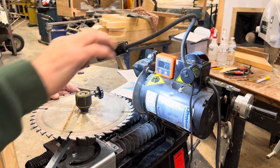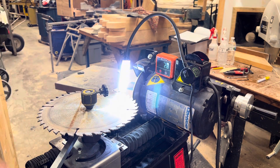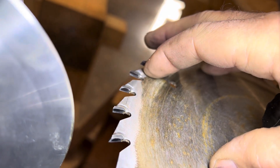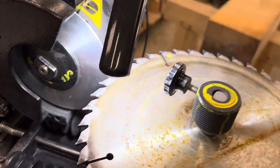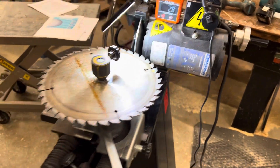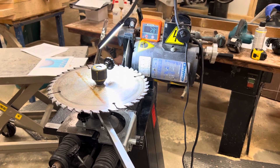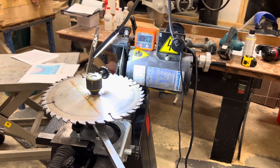Before I do a million teeth, I like to go in and take a look at what the grind looks like. Let me adjust the light and bring the camera around to show you what it looks like. You can see where we touched off on the tooth. And you're going to see that with this blade — somebody had already sharpened it before me — it's not hitting the whole face. So what I'm going to do is take off this little amount that I'm taking off now, then come back and make an adjustment to take off just a thousandth or so more, and that will clean up this blade. But I hope it gives you an idea about circular saw blades and the teeth configuration. The more everybody knows about the blades, how to sharpen a blade, what a good sharp blade looks like and how you get one — it just makes us better at our craft. Give me some comments, click like, and subscribe.